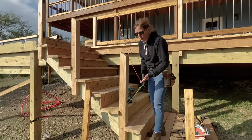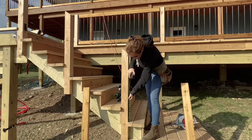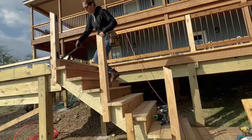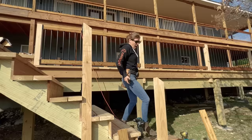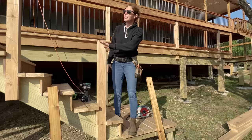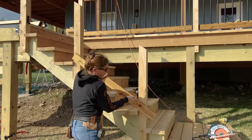It doesn't matter where you take this measurement from as long as it's consistent from one post to the next. On these I actually measured from the top of the post down before cutting it, but you could also go from the step up — as long as whenever you go to your other post you go from the same point. So I'm going from this step up, make a mark, pop a chalk line, and that's going to give you the height you need to set the bottom rail. You can also do that to find the top diagonal. Now that I have this chalk line I'm going to hold my board up — as you can see it's cut long — and trace my angle needed. I'm also going to label this as bottom one so I don't get it mixed up.